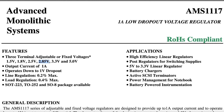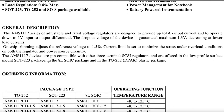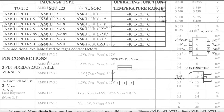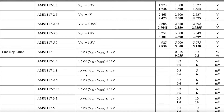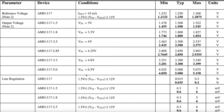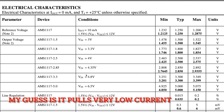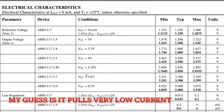There is also a 2.8 volt version if you can find that, and there's also an adjustable one you can set at 3 volts using two resistors. According to the datasheet the regulator should not work with the input voltage that I'm supplying it, but as you can see it is working quite okay.